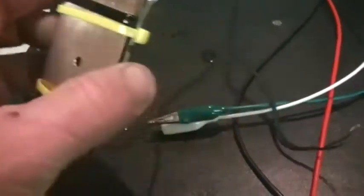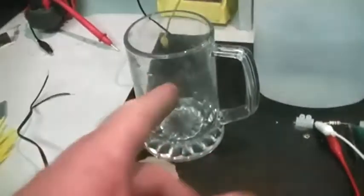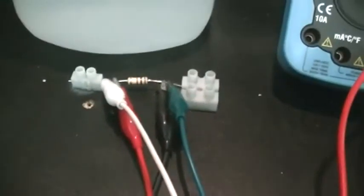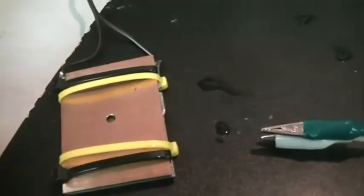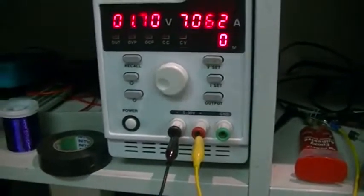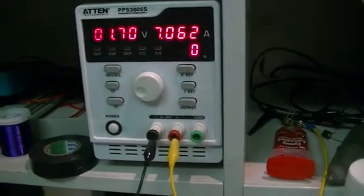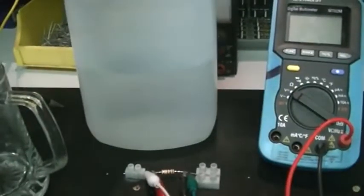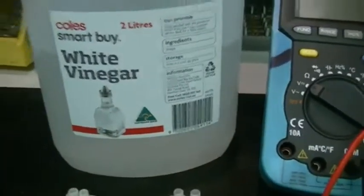This is for our new setup. Our new machine — we're going to start building tomorrow. You're going to need that glass that your cell's actually going to fit into. I could probably use a bit bigger one. Multimeter, 100 ohm resistor, 50 ohm, whatever kind of light you want to put on it — to do your differential testing between a new cell like this and one that you've reconditioned or conditioned. And a power supply. Our first conditioning will be at 1.7 volts and then we'll go up to 2 volts. The other thing you're going to need is this liquid here. Nah, just kidding — all you're going to need is white vinegar, and that's all we need. No other chemicals whatsoever.